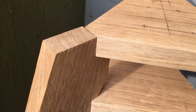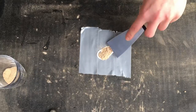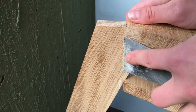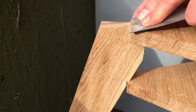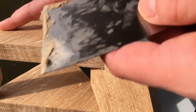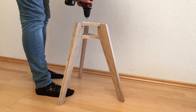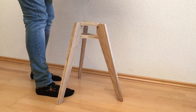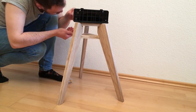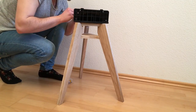This is how my piece looks now — there's some little space in between, so I'm using some sawdust and wood glue to fill up those gaps. Next it's time to drill the holes where the TV will be attached, following the plan I made before. Since the underside wasn't flat, I needed to put in some spacers so the television won't stand at an angle or fall over.